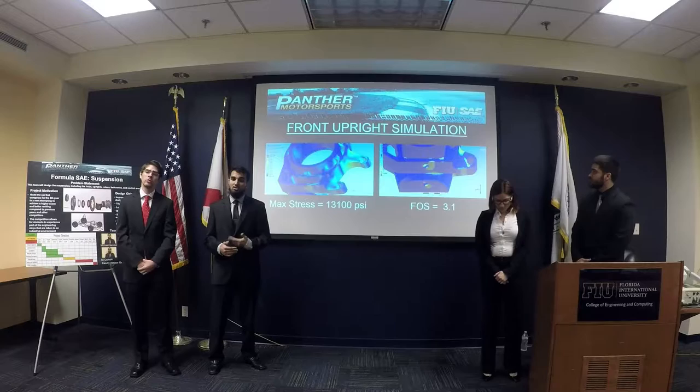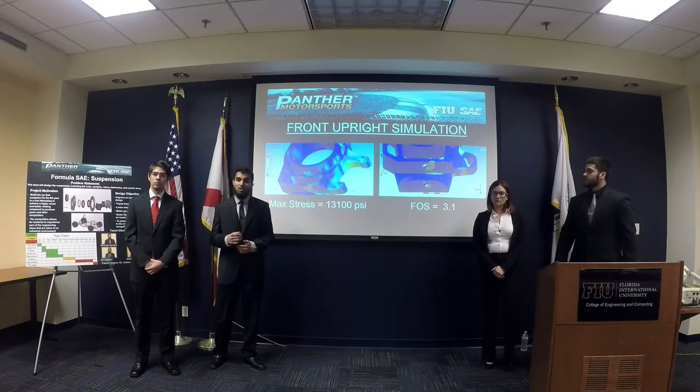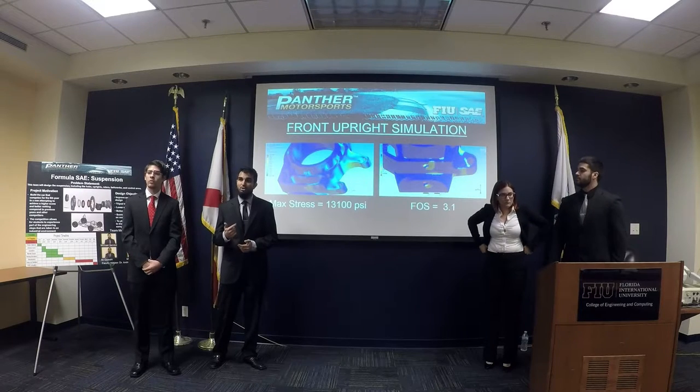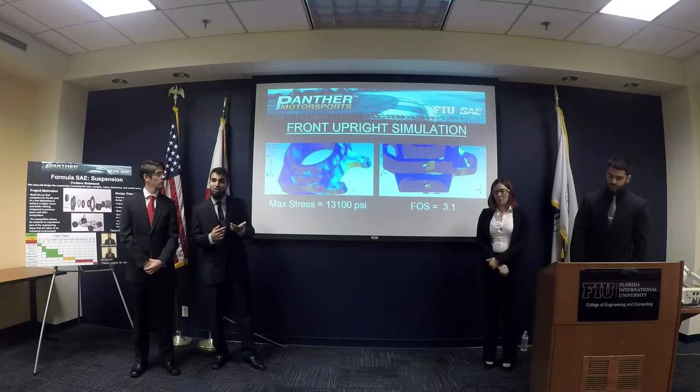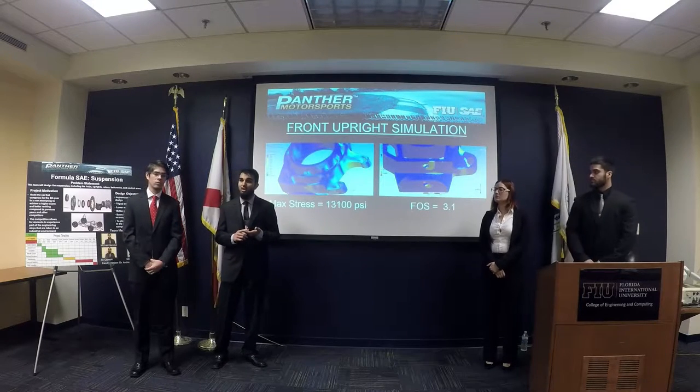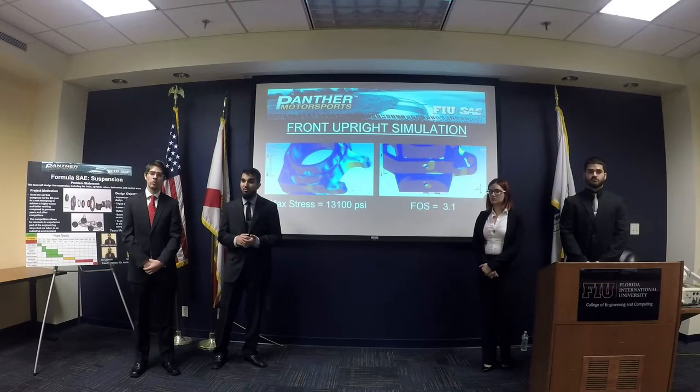The simulations that we conducted on the components took into account forces due to acceleration, braking, and cornering of the vehicle. The simulations use the von Mises distortion energy theorem in order to calculate the maximum and minimum stresses as well as the factor of safety.